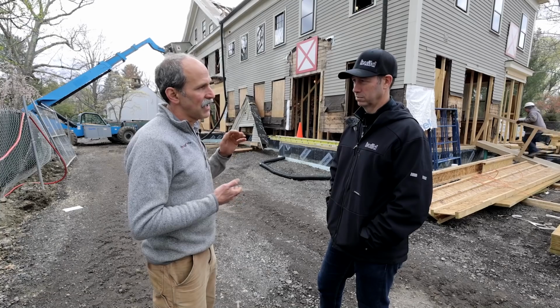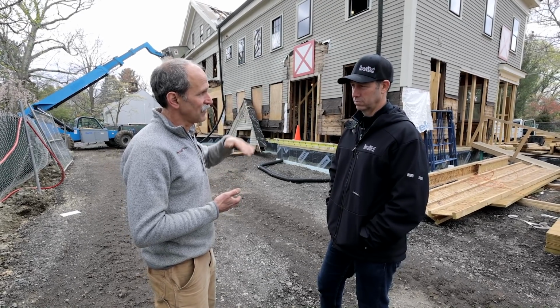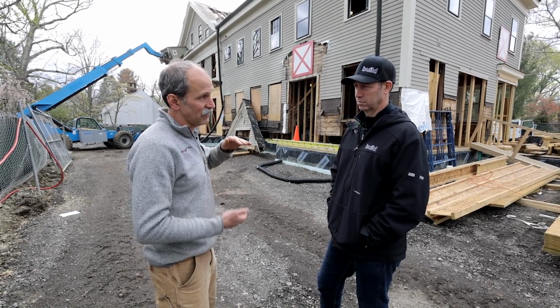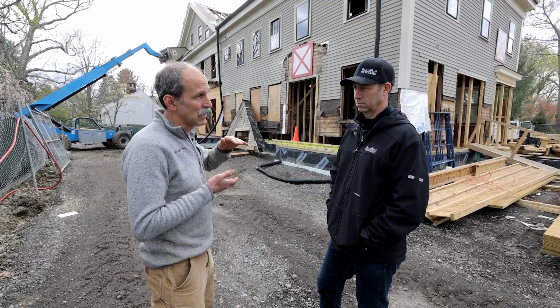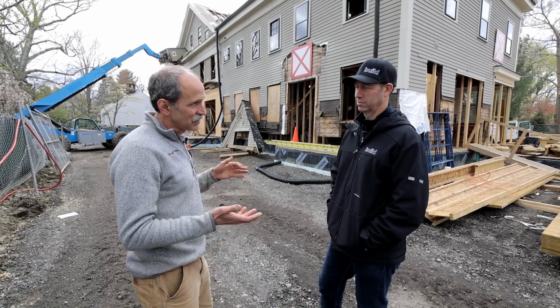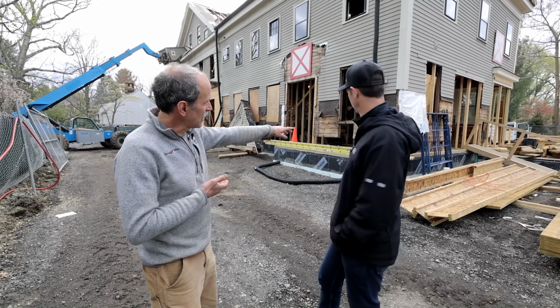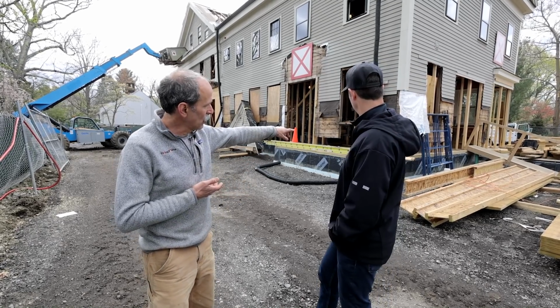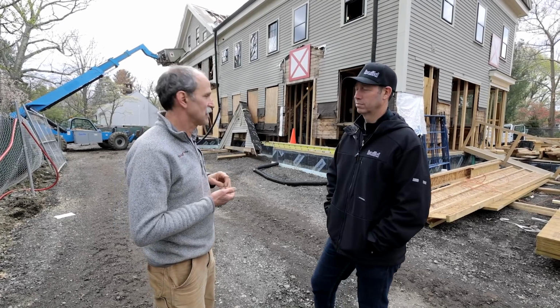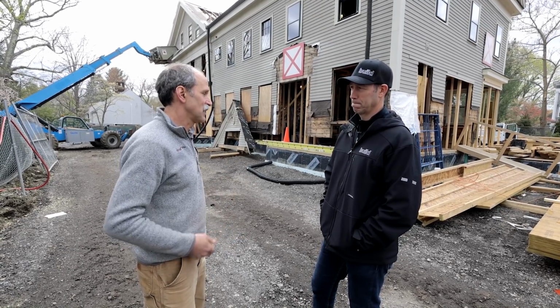So to gain headroom in the first floor, what we actually did is we lifted the building up 5 feet, we put it down 5 feet, but when we brought the foundation out of the ground, we kept it a foot low. And hence, that deck that you saw was removed initially, kind of came to where you can see the bottom of the cut there in the corner. That was where the first floor deck originally came in. Got it. So now we've gained a foot of ceiling height on the first floor.